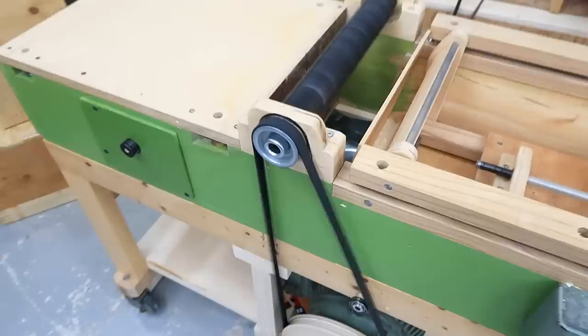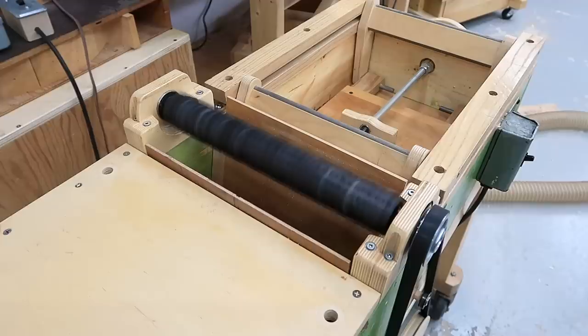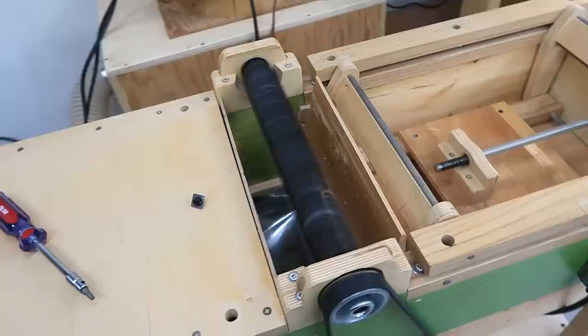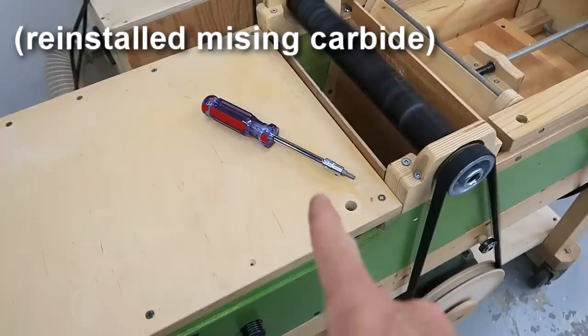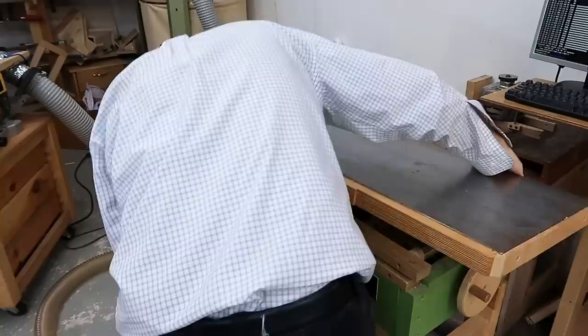One of the advantages of a helical cutter head is they're supposed to be much quieter, but this is not a good sign at all. I just removed one carbide cutter to try it again and it's a bit louder than before — I think this thing is just kind of out of balance. This shouldn't be jumping like that; this head is out of balance. I'm hesitant about putting the jointer back together right now because I have the feeling I'll be taking it apart again real soon.